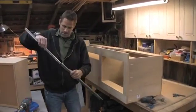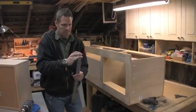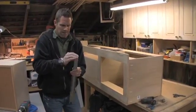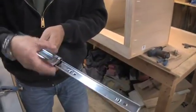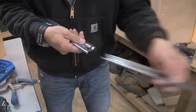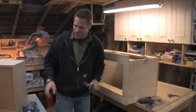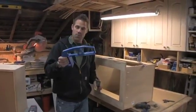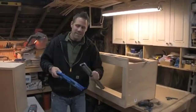You take out this little runner right here. I should show you as I just put it back on. Let me stick it back on to show you where to pull it. On any kind of drawer slide, you'll see on the side, they normally have either a button, and this one has a lever. So all we do is pull that off, remove that, put that aside. Now, it's my new gizmo. This is a drawer mount by Kreg. It makes it so much easier.